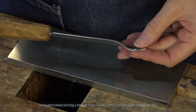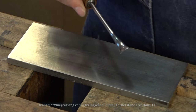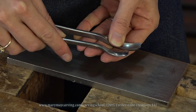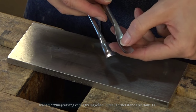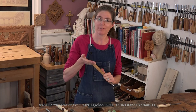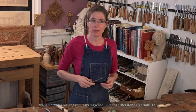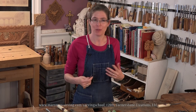If you look at it from the side, it comes like this and bends down, but if you look at the blade, it's curved this way, where the spoon bent was curved the other way. Similar curvatures of the shape of the metal, but if you look at the blade, that's where the difference comes — the spoon bent is actually scooped like a regular gouge, but this one is in reverse. The times when this is needed is if you're trying to get into some areas where you need to have the tool sort of lifted off the wood, and you want to be able to create curves like this. Very handy when you need it, but quite often I use other gouges in place of this. But again, when you need it, it's really, really valuable, and you won't regret actually purchasing it.